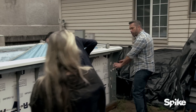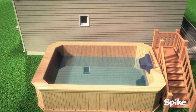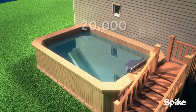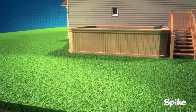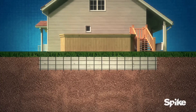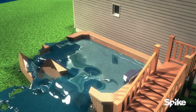Do you remember seeing him pour any concrete piers or anything? No. I have photographs of it, and it's just the wood. The swim spa that Beth bought was designed to hold 2,500 gallons. At 8.3 pounds per gallon, even this relatively small pool would weigh over 20,000 pounds when full. With that much weight bearing down on a pool's base, a proper foundation must be built — a thick concrete slab reinforced with half-inch steel rebar. Without a proper foundation, a full pool will sink into the loose soil below, eventually causing catastrophic failure.